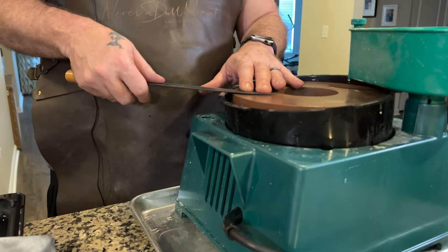Now you can definitely see that there's removal in this area. We've got to work here and here. It honestly did not take me that long to do it — I did the other knife last night. It's obviously going to take less time if you're using a more aggressive stone. A lot of the cladding has already been removed in this area and we're starting to get closer to the core steel exposure. You can still see the high spots and low spots, so you're constantly doing a little bit and checking.